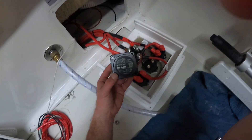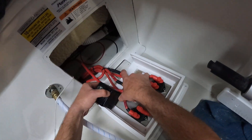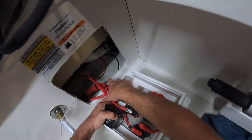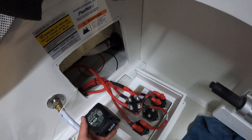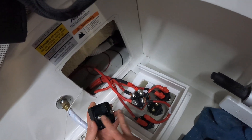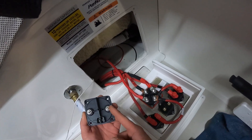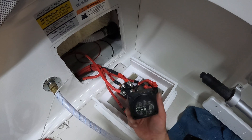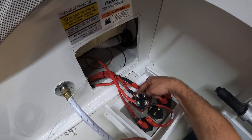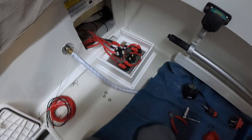Now, to facilitate a charge from the starting battery to the house battery, we're going to put in our ACR. I didn't see a great mounting position but it looks like if I move this wire over here, the ACR will fit in the corner of the box. Basically all we have to do is connect two studs — one side goes to the house bank, the other side goes to the starting bank. This thing's going to automatically regulate the charge available from the engine at all times. We'll come back and show you that when we're done.